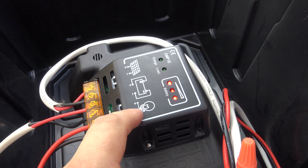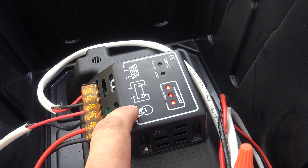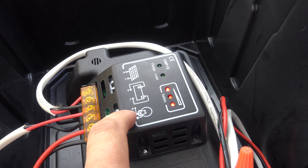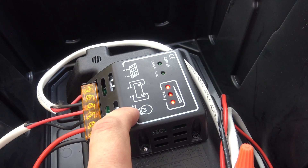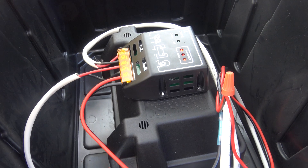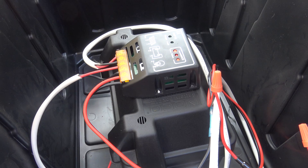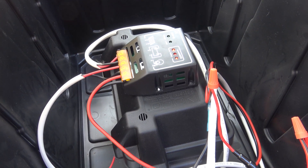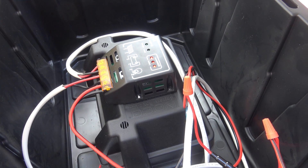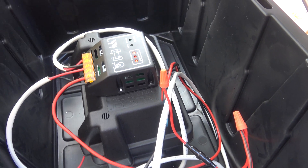While it's sunny out, the solar panel is sending energy in and charging the battery. However, if the battery is already full, it's not going to allow it to overcharge — which is really important. When we have a load like the pump running, it's pulling energy from the battery. If it's sunny, you're creating as much power as you're using, or often more. When it's dark, the pump is still pulling power from the battery itself. I've sized this with a deep-cycle marine battery so I can get away with pumping water for 24 hours on a single charge.